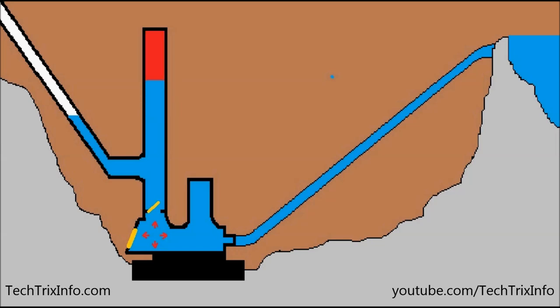The air is getting pressurized — pneumatic pressure is happening. Up to a limit it happens, then that air exerts that pressure back towards the water. This results in the delivery valve also getting closed. And the water is being pumped outside due to this pneumatic pressure.